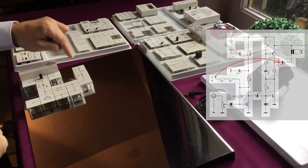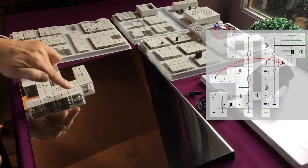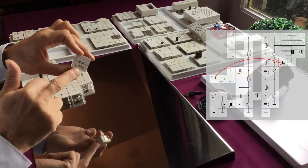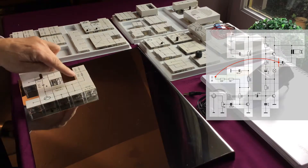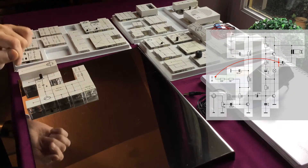Later on we will add some more blocks here. To make our transistor work, we need to connect it to the power rail by using a resistor — we use a 4.7K resistor and place it here. Now current can flow through this resistor, through the 100K resistor, to the base of our transistor, and it should work.